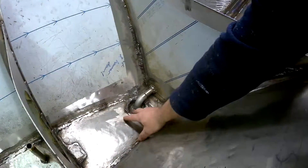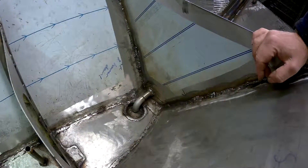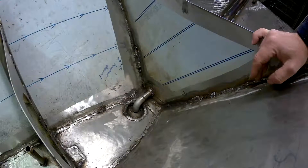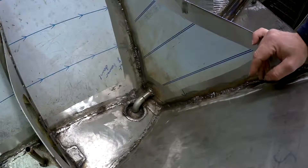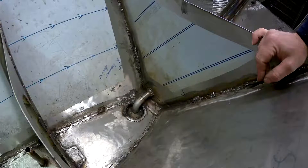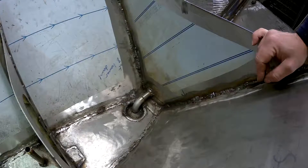The water pickup point for the pump is positioned so I'm more likely to get almost all the water out of the tank. That means very little unusable water storage capacity — you'll be able to use almost all of the water you've put in. The other thing is I want to be able to really drain down the tank so that if I'm leaving the boat for a period, or if I need to clean the tanks, I can get the old water out.